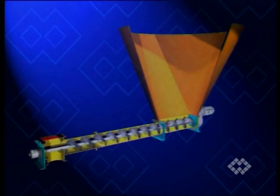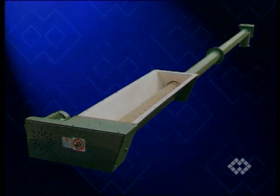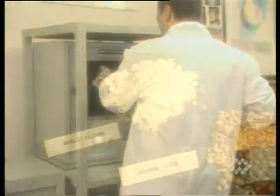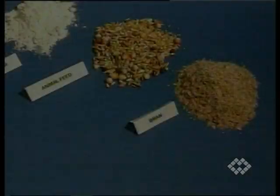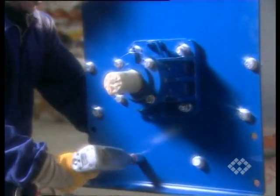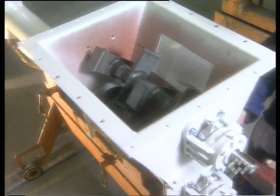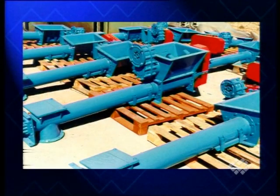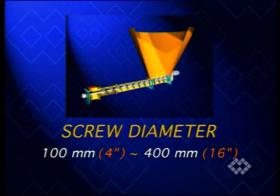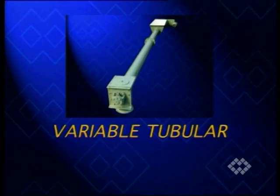According to the cross-section of the silo outlet, SU-type single-shaft screw feeders are available with standard U-shaped or with flat trough. In a light-duty version, SU feeders are used for flour materials with similar bulk density and properties. For animal feed and similar products, a heavy-duty version is available. In the D.O. version, the feeder is equipped with an additional inlet hopper including an agitator tool. Screw diameters range from 100 to 400 mm, open trough lengths from 500 to 1,500 mm, whereas the tubular length is variable.